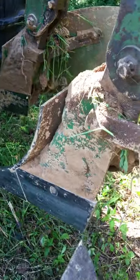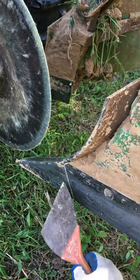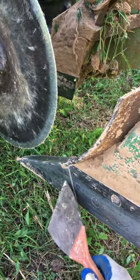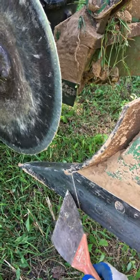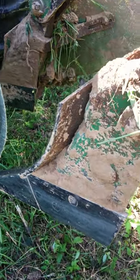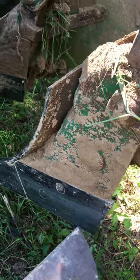I also had buffed up the landsides, and this is the gunnel portion — this flat surface in front of the landsides is part of the old-time share, it's called the gunnel. It's also important that this will scour and be sharp. It's also important that these landsides are in good shape; they have a lot to do with keeping your plow straight.